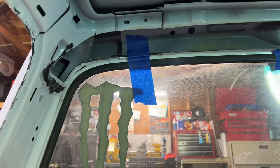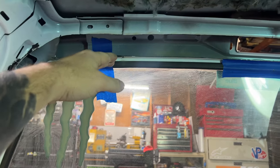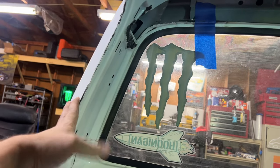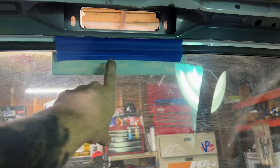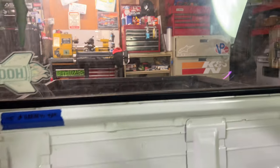The biggest thing with knowing where the bends are gonna start, I always go from center and bend out. So where my first bend hits is crucial, because if it's too wide, it'll start curving in down where this section would be. If I do it too soon, then I'm coming down too quick. So what I always do is I go from center point, make a reference, and then on my template tube that I always keep around, I have the bend start scribed in it. So I always know where it's at.